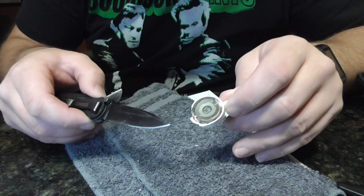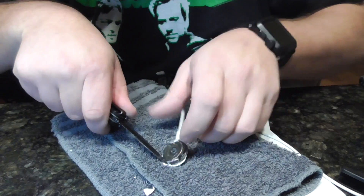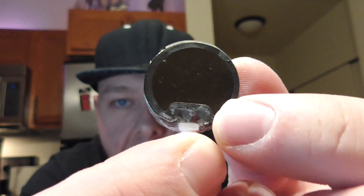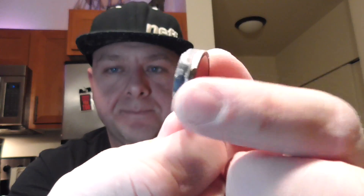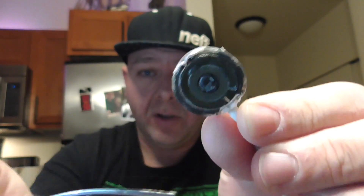This is definitely your magnet here in the middle. It looks like this thing was actually waterproof or sealed up. You can see there's a layer of glue all the way around and it's completely filled with some sort of epoxy or something like that. Metal backing. Then we've got the actual coil here, and in the middle we have our little magnet.